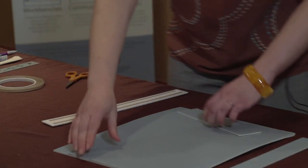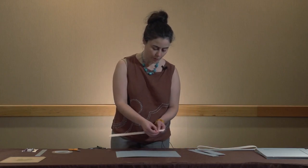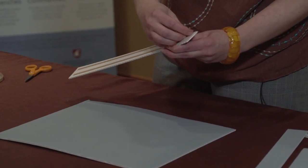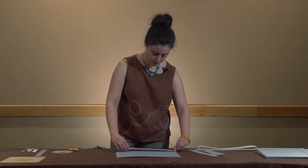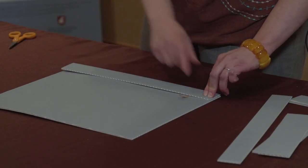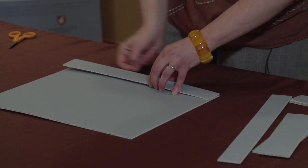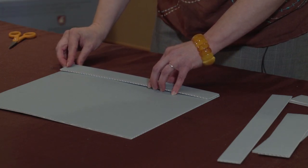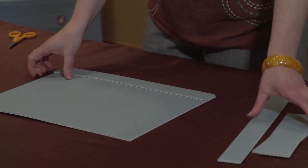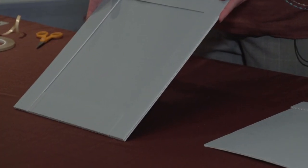Now, something I like to do when I'm placing an object with double-sided tape is to peel off part of the carrier so that I can see it from the other side, and then position it before removing the carrier completely. And so positioning it so it lines up with the outer edge of the board, I can tack down that edge which has the exposed adhesive, and then remove the release layer from either side, and then put pressure to get it in place. And then repeat that for all 4 edges, so that you have this, which is your sink.